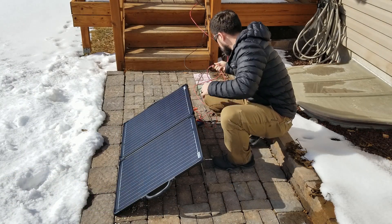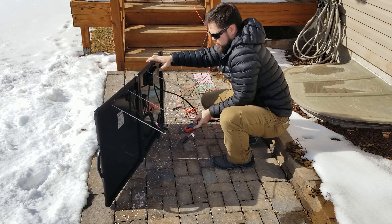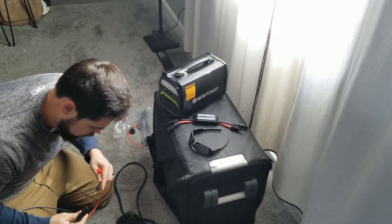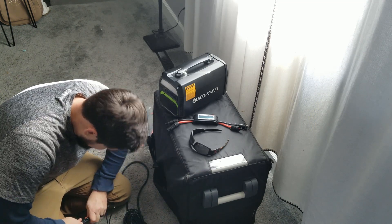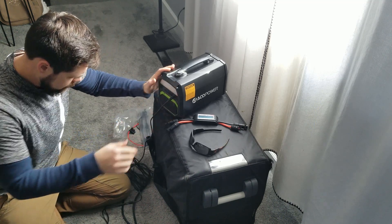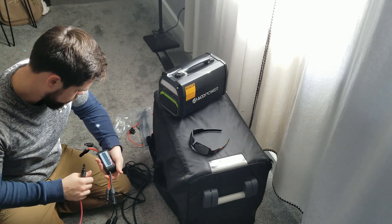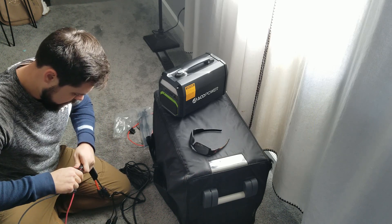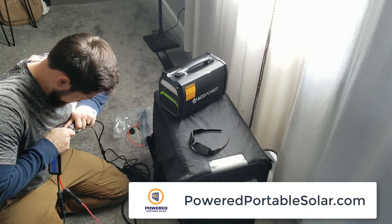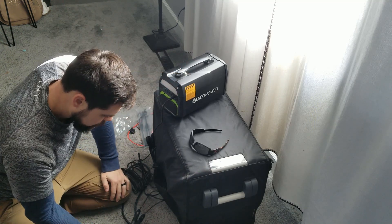I've got the panel here with my panel cables. Make sure you go directly from the smaller junction box — not off the cable with the charge controller. I checked the voltage: 22.5 volts. The included cable wasn't long enough to reach outside, so I added my own solar cables. After plugging in and adding the watt meter — custom-made units, a bit pricey but they handle the most amperage and voltage — I'm getting 22.53 volts and about 70 to 72 watts, though it's fluctuating due to clouds.